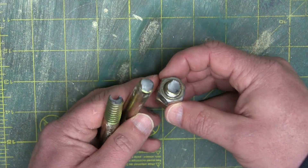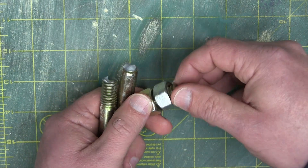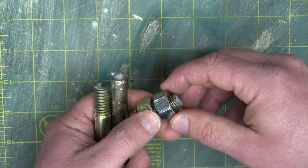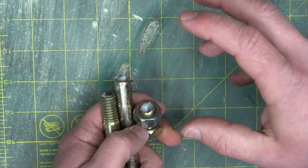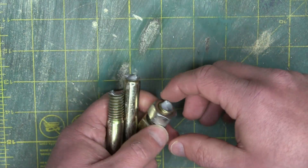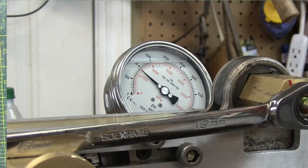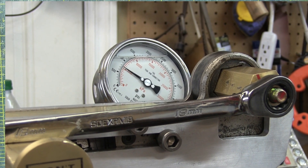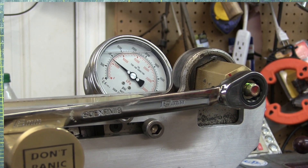Back to the long-suffering green cutting mat. The question was: how much torque is too much torque? On lubricated threads — not super clean, not totally dry — it takes about 200 to 250 percent of spec torque on a half-inch fastener in order to break it clean in half. That means you've got a lot of leeway there. You can over-torque it quite a bit and it's not going to break on you. However, we saw with the gauge going up, if you over-torque it, it actually weakens the bolt. So you've got to watch that.